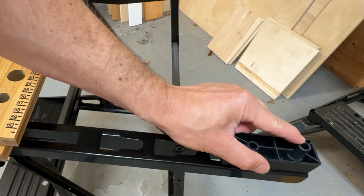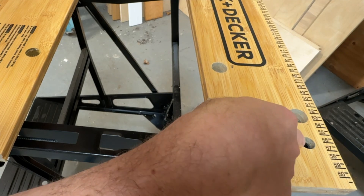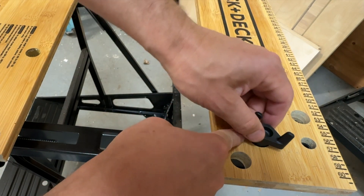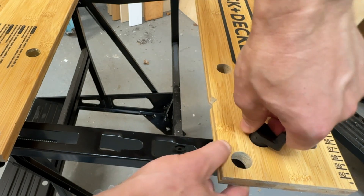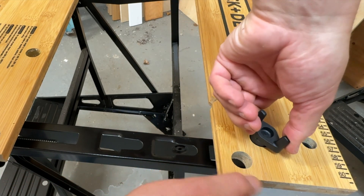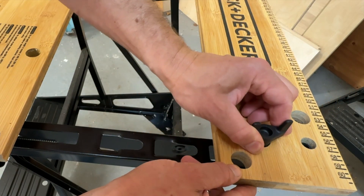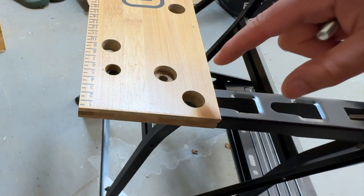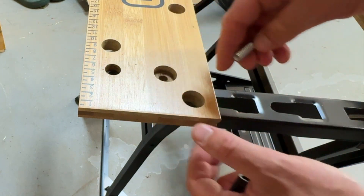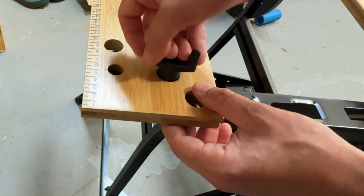This piece that sticks up is in the back. Place this here and line up this hole with the piece that sticks up — the furthest hole with the piece that sticks up. Now get the last two bolts. That bolt goes into the front hole — the wider one — and it'll thread directly into the black slider. In the front it doesn't thread into the slider, it threads into that white piece. In the back, you don't have a white piece, so this is not adjustable using the handles — it threads into the slider. Don't over-tighten this one since you're just threading it into plastic. Repeat that on the other side, lining up the front hole — the one with the extra width — and you can feel the bolt catch. Tighten it down.